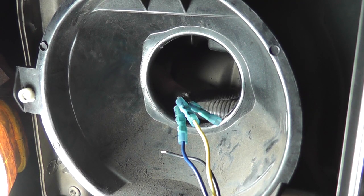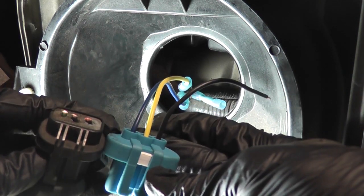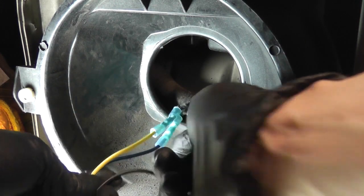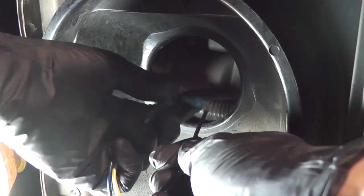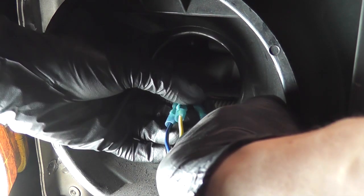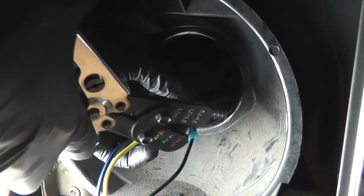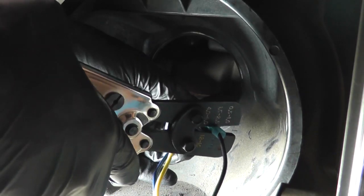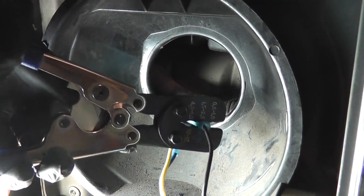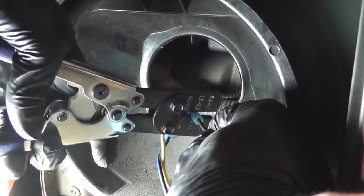This is the final wire so everything should be right, but I'm just going to check anyway. Final wire — red with a black stripe. And that's the remaining wire right here, so the black wire goes to the red wire with the black stripe. Engaging the ratcheting action of the tool, then I'll make sure the wire is pushed all the way in and crimp.